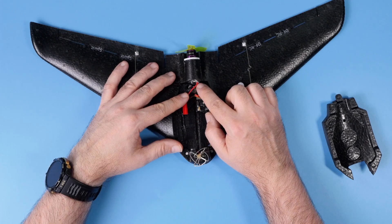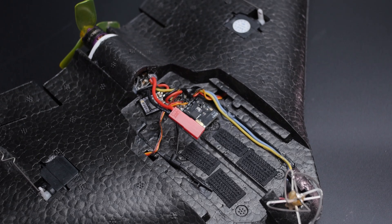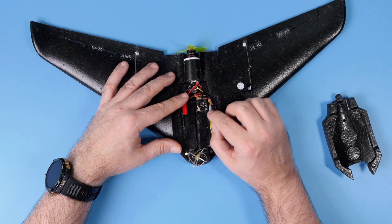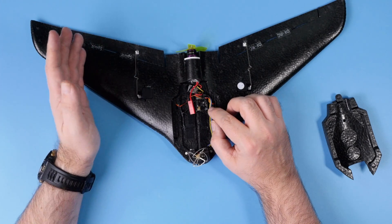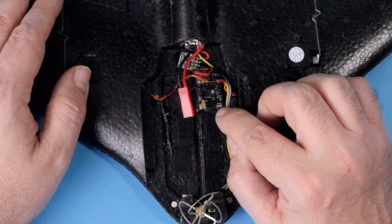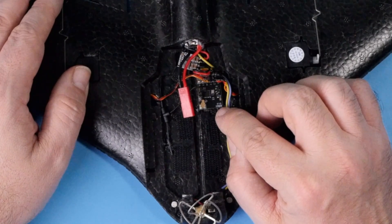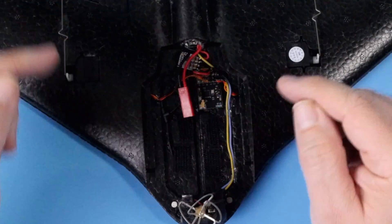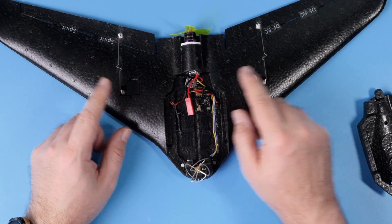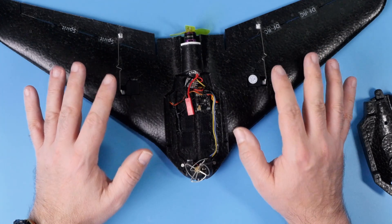Here at the end is the smallest brushless ESC I was able to find, because with this teeny tiny motor it doesn't really matter how big the ESC is. As a complete bonus there is a 2.4 GHz ExpressLRS receiver — this is the ER61 from Radiomaster, but any with PWM outputs will work just fine. This is three channel only: one channel for throttle and two channels for the servos, and the mixing happens only in the radio.